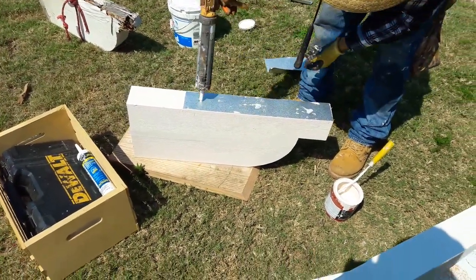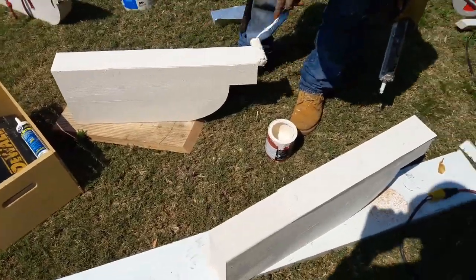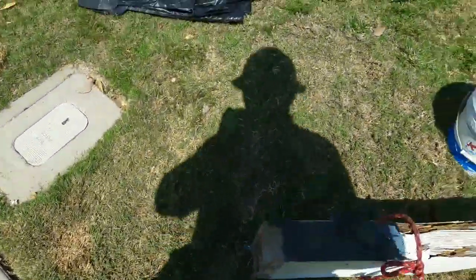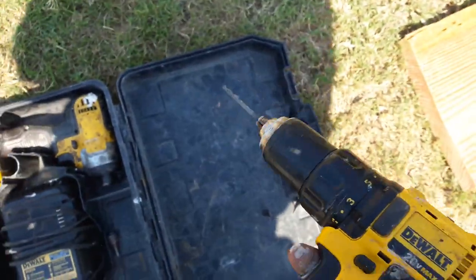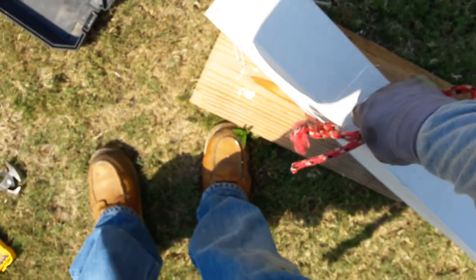Paint it over — and this is the rotten one. Make sure you pre-nail the nails before you put it on the roof. You attach it — since I'm going up there on the ladder by myself, I pre-drill some holes with the drill, then I put the nails in place, and then I'm ready to go up. I tie my corbel with the rope and carry it up like that.